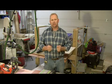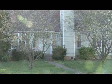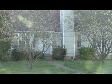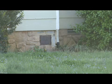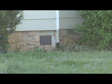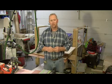Now, there are several things that you get into when you find an older house that you're going to invest in. And typically it has to do with the service that's going in there. A lot of very much older homes, that may have been built, say, in the first part of the 20th century, in the early, say, prior to 1970, you might find some of those that only have a 60 amp service because that was only required.